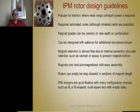Since this is a punching for a core, you can design this with a magnet in a V and get some saliency out of this rotor punching, to get some reluctance torque to make this into a hybrid. You get a permanent magnet component and a reluctance component. Magnet retention is almost free in this case using this IPM design, because you have some retention webs here and here that hold the magnet and this mass in place at speed and against vibrations.